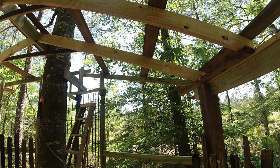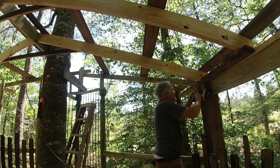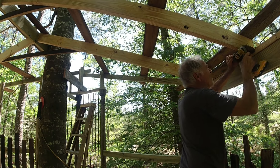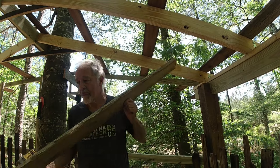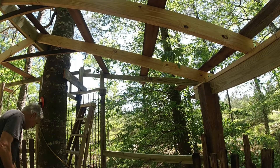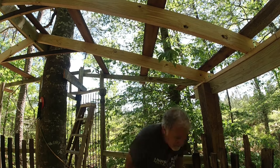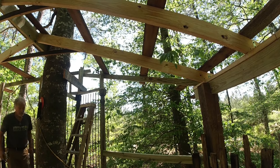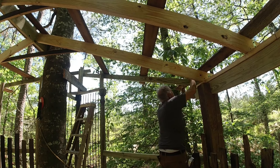I shoved it up and clamped to the stripping again — that's the top of the rafters, the stripping. Then I'm going to take a little board and scribe it. On the other side I cut a vertical, but on this side I cut a wedge that fits underneath the rafter and holds it up. Up top it's screwed to the vertical, a little short two-by-four, with a longer one at the point where the two rafters come together. I can see an issue where the rafter on the back and the rafter on the front aren't lining up — that's because the center of the structure, the center of my two bars which is the point going out past the trees, is not centered with my ridge. I probably could have shifted the pointy part of the deck over and made it centered, but it worked out okay.